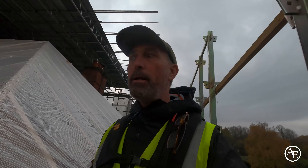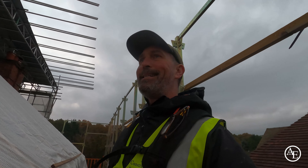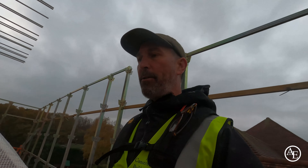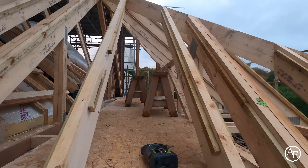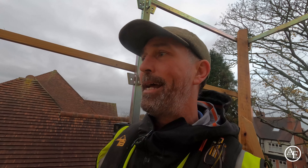On Friday we've got the patio in the back arriving, so I'm really looking forward to that. Once that's in, once we've got watertight, we can then start to get the underfloor heating down and get that through and get the screed down before Christmas as planned. Al's been putting the breather membrane in. Even though the membrane we're using is an amazing membrane - you actually don't need any breathable gap at all. It's a new felt which I'm going to talk about in a separate video, because I do think it's a really cracking product and a game changer.